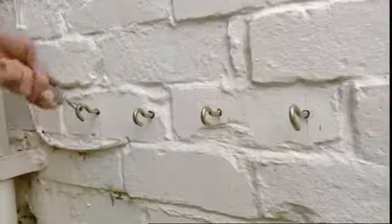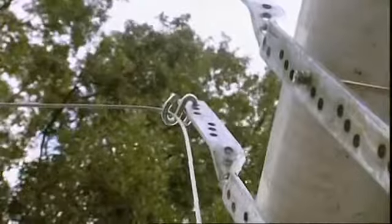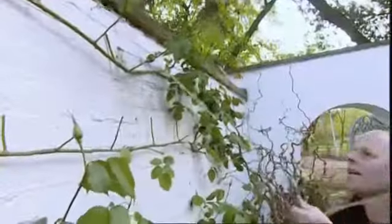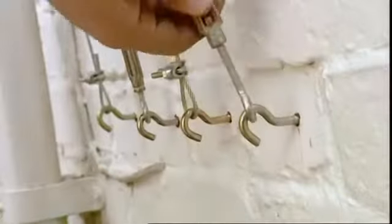If you want a free-standing pergola, you've got to be careful. If you concrete posts into the ground, once you tension the cable up, the posts come together and the whole thing flops — believe me, I've been there. We've run some screw hooks near to the ground to start the wires off, so they run vertically up the wall, get looped through the hooks and stretched right across the span. Finally, they're fixed through the barrel strainers with special clamps, and then you just tension the cable up.